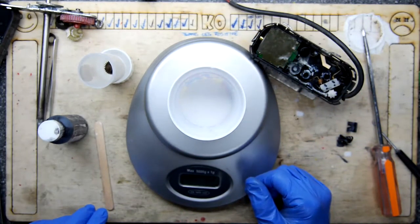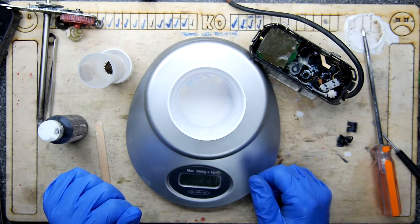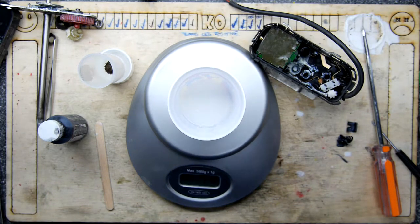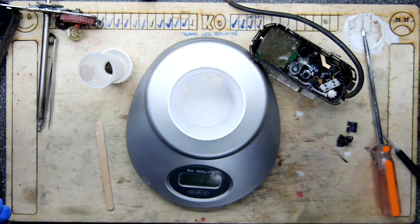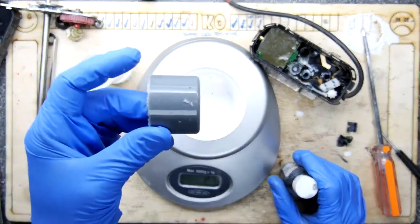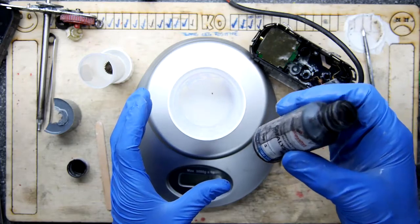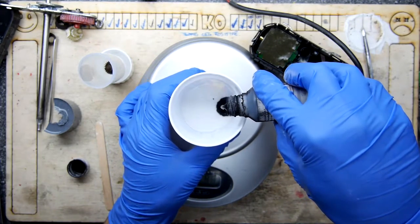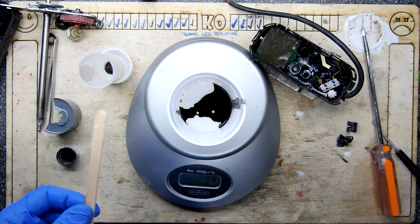You've got 32 grams, so you think: five to a hundred — what does that give you? Five percent of 300 would be 15, so five percent of 30 is 1.5 — it's tiny amounts, you won't be able to measure it properly. What I do is mix this up by eye, because you've done it before — you're looking at that color. It's got a pigment in it designed to help you actually measure. Just be careful pouring because it tries to drip down the edge of the bottle every time, then mix it up and don't put your spatula on your board.